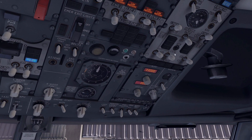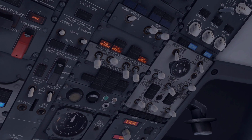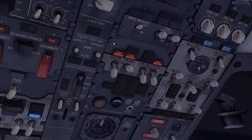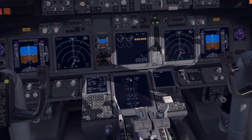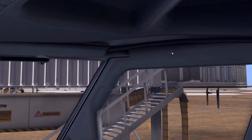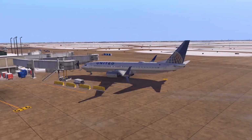And there's a 1 minute waiting period between the starting of the APU and engaging of the APU bleed. So I'm going to wait with that, and B system can be pressurized. And these guys. Anti-ice, we don't need it. I think the procedure is when the outside air temperature is below 10 degrees and there is visible moisture, then anti-ice is required, but actually it's pretty great weather right now.